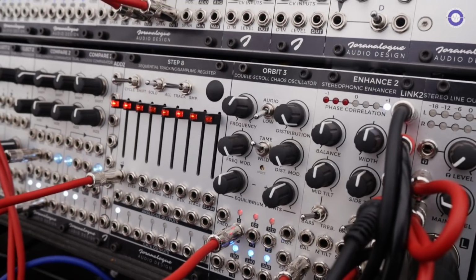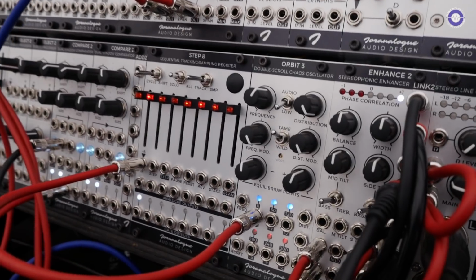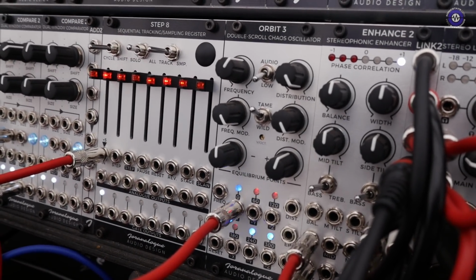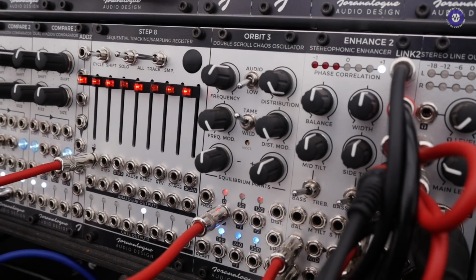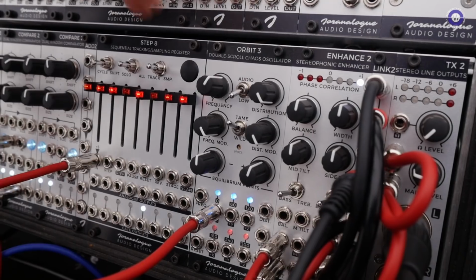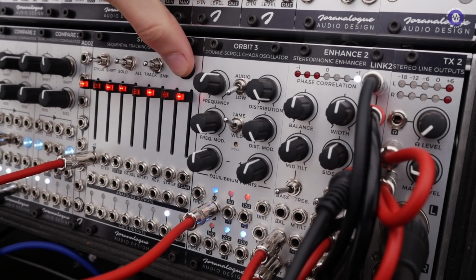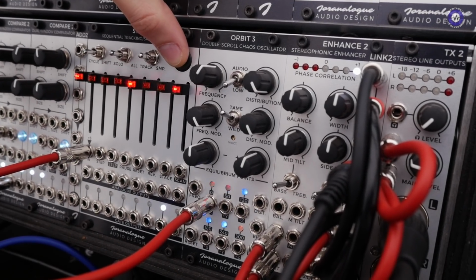So it seems like a kind of Swiss Army knife and can do lots of different things, right? Exactly, because apart from the cycle mode, which is your sequential switch mode, it also has a shift mode, and now it becomes an 8-stage shift register, analog shift register. It can also track or sample, so I put it in sample, and now we have our 8 stages of analog sampled signals being shifted to the right on each step.